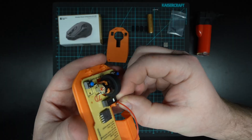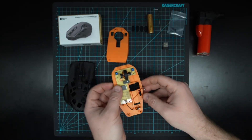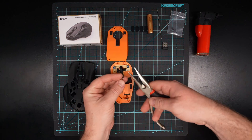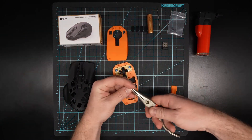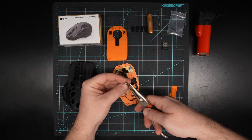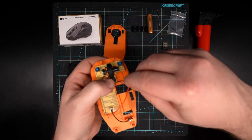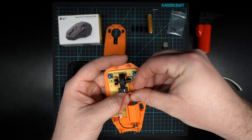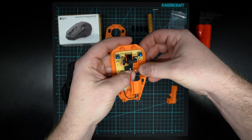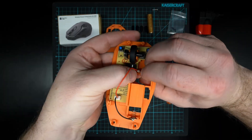This one is just ripping in there — it's biting into the plastic and not letting me push it in. I'm going to get a little tiny plier and fix that up. I'll just squeeze these down a little bit on both sides to flatten them just slightly so it fits in a bit better. I don't want to flatten them completely because then they won't bite and it'll just pop out when I put a battery in. That's better — now it has gone in and won't pull out.